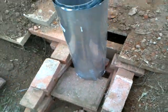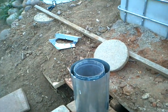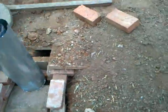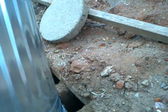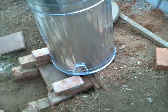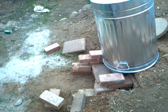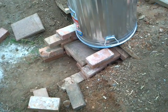The inside of the tube is hot, the outside is a little colder. Once that's put together, I take it and put it over the top of the burn chamber. Once it's going up that tube, basically the heat rises — and then that's what this barrel's for. Put that over top. But then I'm going to cover these two holes where the air mass is, so it's going to force down into that. I'm going to have to bury the whole thing basically, and leave it so that that's where the air has to go. Trap in that heat as much as I can.